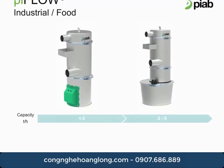Flow capacity can range from a few hundred pounds an hour up to that 5 tons per hour mentioned earlier. Our actual typical sweet spot is closer to 100 pounds an hour up to 3 tons per hour. The max flow capacity is dependent on the pump flow, the filter media surface area, the volume of the receiver, and material characteristics.